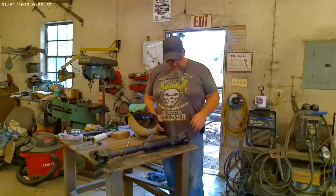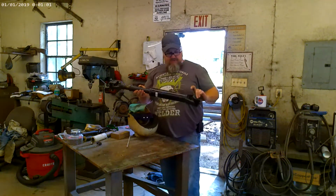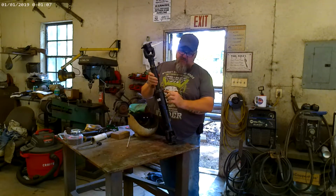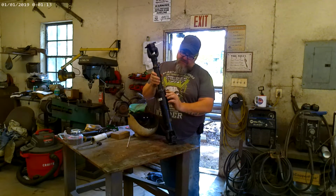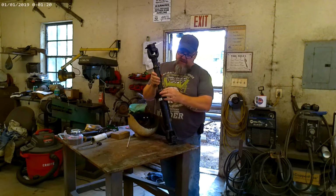Shop. We had a customer come by, and he's got two drive shafts that he's brought us, and they're both a little bit too long. So we're going to start off with this one. These are fairly simple to do. You just want to go back to the original weld and cut dead center a bit and take it loose from there, and they'll give you a clean edge to start with, and then we'll take off the length that he needs and set it back in.